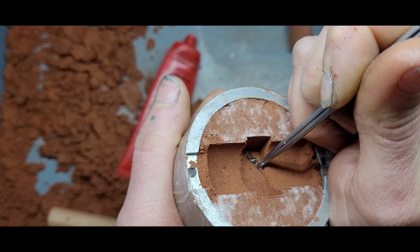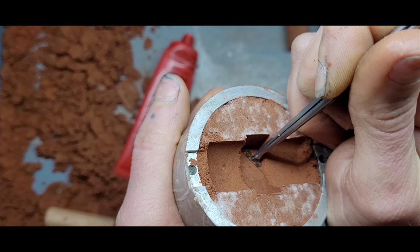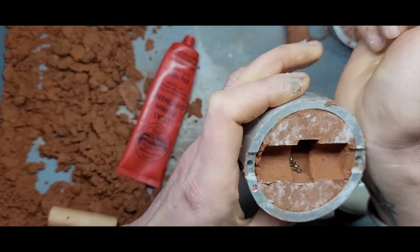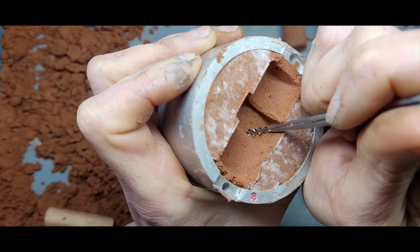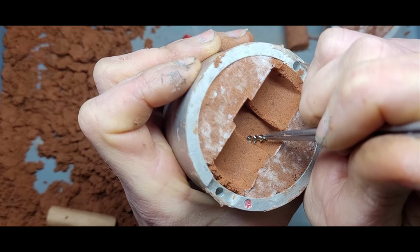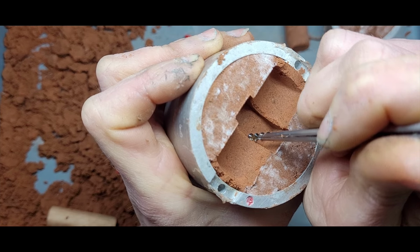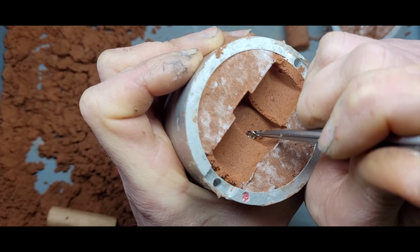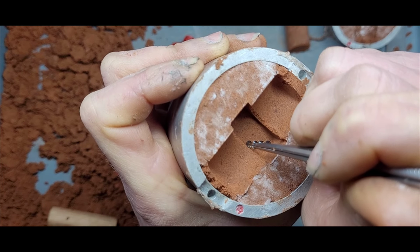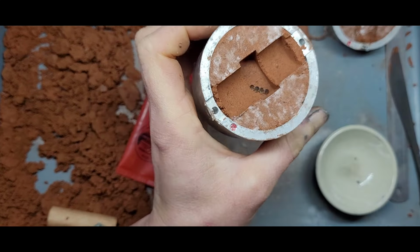So I'm just going to do 4 stones because I can't quite fit the 5 in. I'm just positioning them now and giving them a gentle little bum press. That's to make sure that they are in contact with that clay surface, but I am not pushing them into the clay. Just making sure they're in contact. And that pawpaw ointment is making a little bit of a seal to help hold those stones down against the clay. I'm also making sure there's a teeny tiny gap in between all these stones so that as the metal cools, it'll have room for the stones to not break each other.